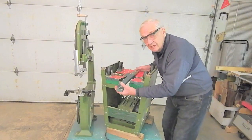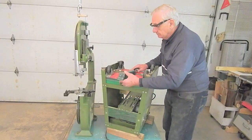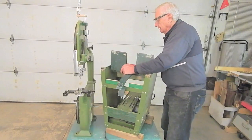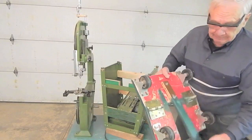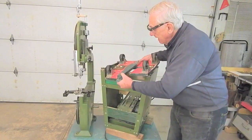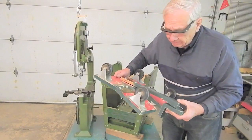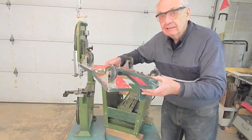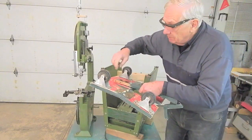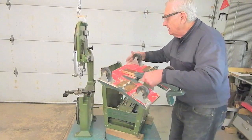Here's the pedal and actuating arm installed, bolted to the rear caster mounting board. The pedal rocks to latch in the notch to hold the casters extended, and it rocks on the end of the actuating arm with a small hinge. I had to add a few washers between the arm and the rear board to get the right amount of travel for the casters extended and retracted.